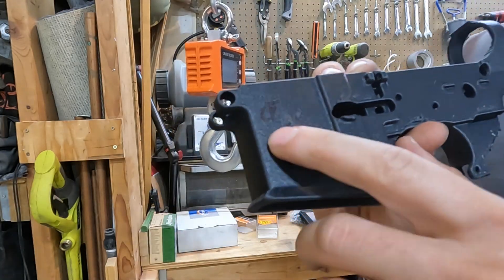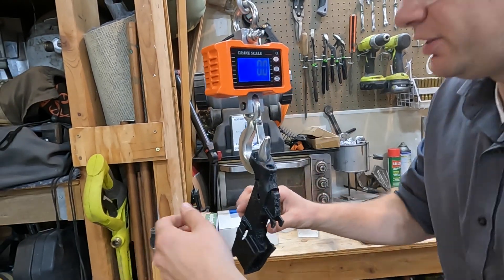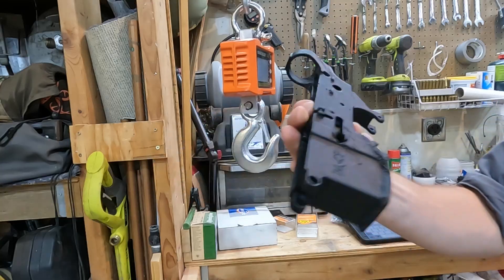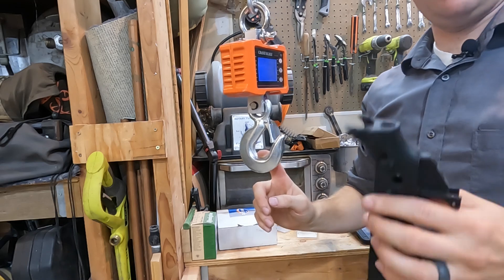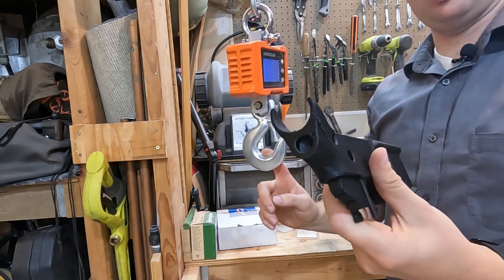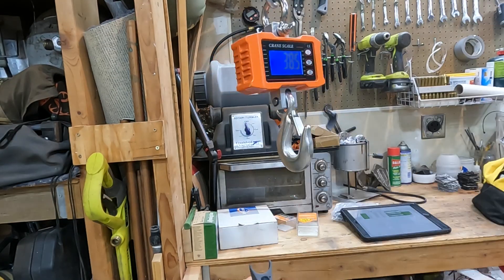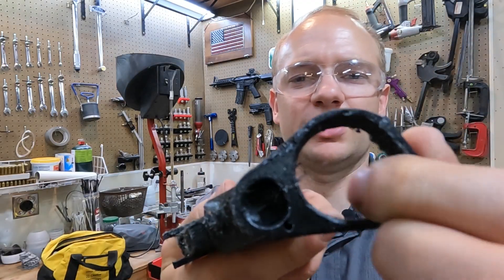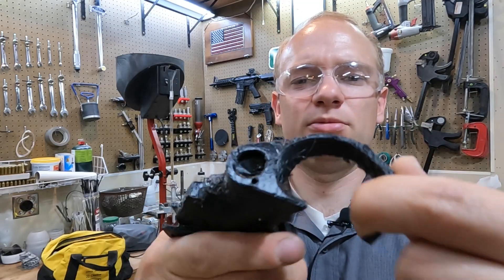This is a carbon fiber polycarbonate — I forgot to update it. Okay, here's nylon — expecting great things. 68 and a half. There's a carbon fiber nylon — that one must not have printed well because it just busted and I don't have a good way to repeat that test, so we'll just note that one. Okay, there's a glass fiber nylon. What's interesting with the nylon is only one side broke and the other side is still relatively connected — you can see how flexible nylon is and how not brittle it is.